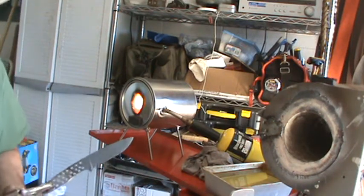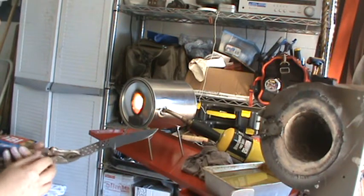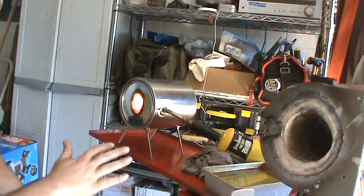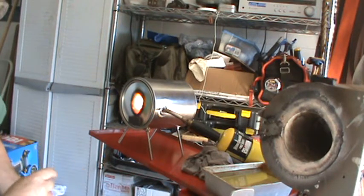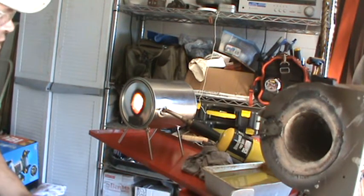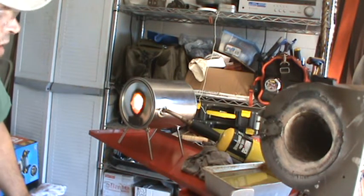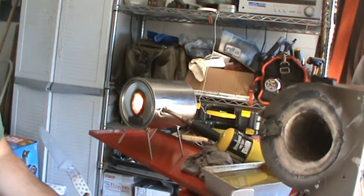I've got my blade here ready to harden. I'm using my micro forge to harden this 1084 steel. I want to harden at least the lower half of the blade. I'm using map gas, not propane — I didn't get enough heat with my propane torch, so I switched to map gas. I'm going to quench in canola oil in this pie dish, and I've got a rare earth magnet right here to check that I'm past non-magnetic before I quench, to be sure to harden my steel.